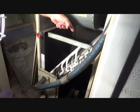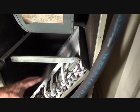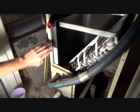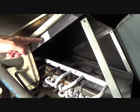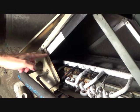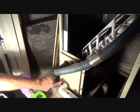There are aluminum fins in here — see how they're silvery? That's all supposed to be metal like this, and then when it gets cold it goes like that, and the water kind of drains down in here, and there's a pan in here. This is actually the pan. It's kind of inverted, and there's a red cap here and also a red cap down here, and you can clean this. It says caution: avoid damage to plastic pan, do not use strong alkaline cleaners — pH 9.5 or greater. Clean the coil with mild detergent and water, rinse coil and pan thoroughly with clear water, and I think you would take this cap out.